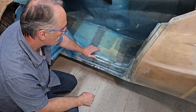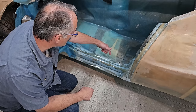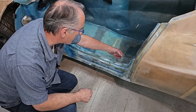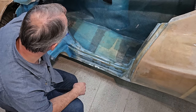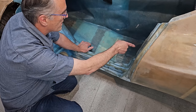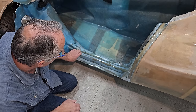We have side rails - one on each side - a floor made up of a multi-piece structure, a very large tunnel, and of course the roof with core materials in it as well. Once you tie those together it's like a bundle of sticks - you can break one stick easily but put a bundle together and you can't break it. We're relying on geometric shape but also on sheer mass of fiber along this structure. On the sides of the tunnel are layers of unidirectional fibers - just long tapes, layers after layers - with foam cores added, then more unidirectional fibers. Those fibers run along the longer axis, come up, go into the footwell, spread out at the front, make the bend, and tie into the bulkheads.